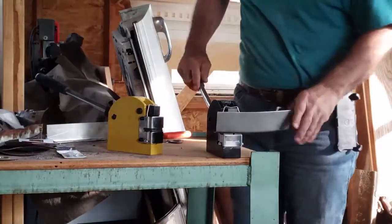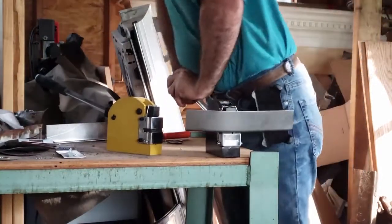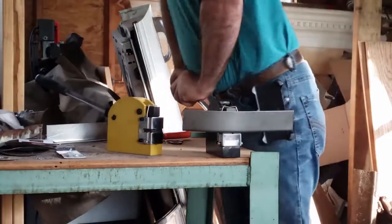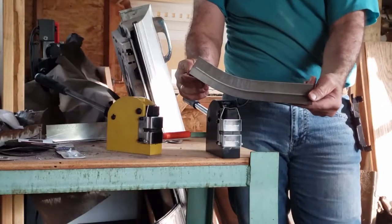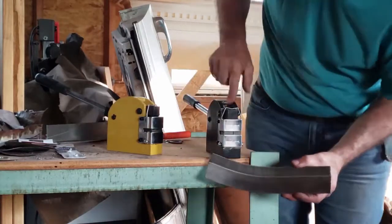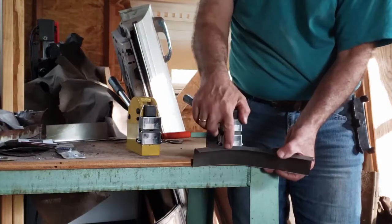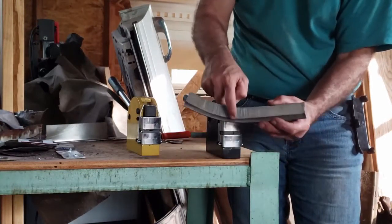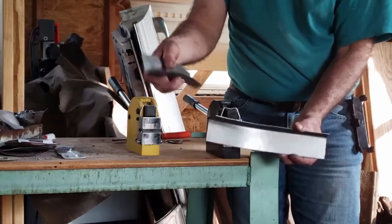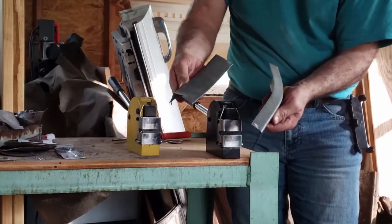You can see it's really coming together. There's the radius — because I'm shrinking it, it's bending into a U-shape. The arrows are pointing in, so it is the shrinker; arrows pointing out is the stretcher. I shrunk this to get a one-inch radius, which is why I'm working with two different pieces — this stretch piece has a different, two-inch radius on a different angle.